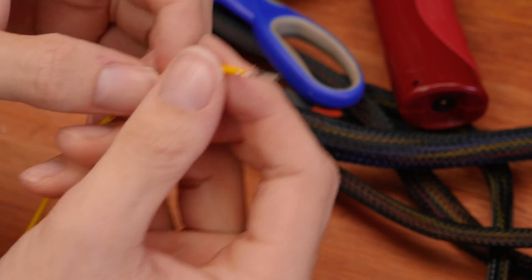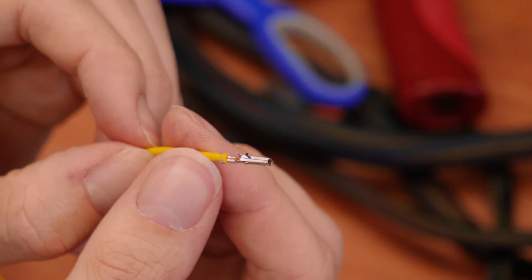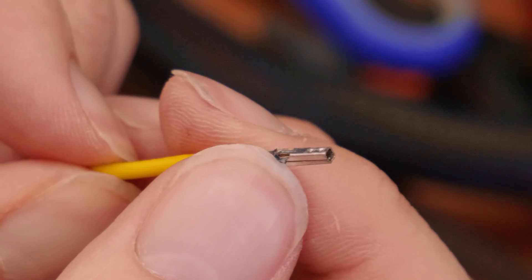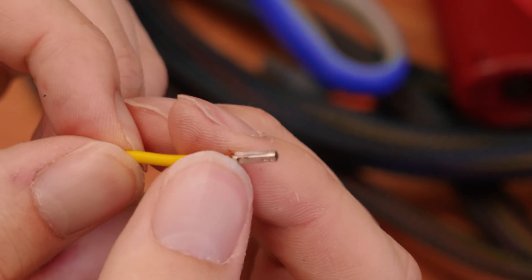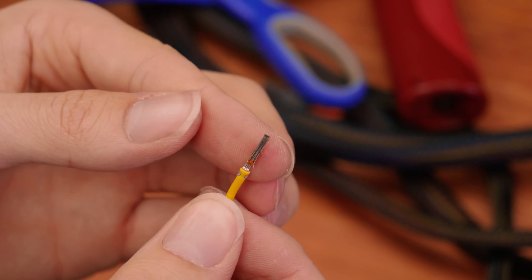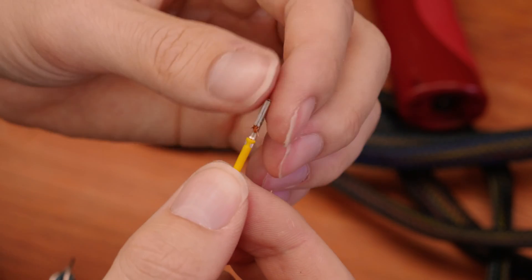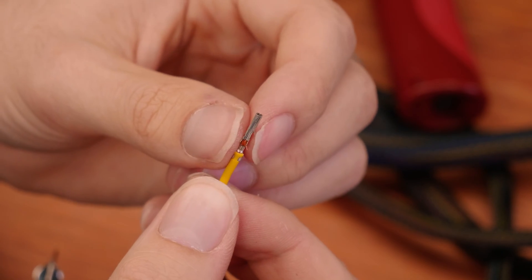So if we take a look at what we've actually got here — we can see it's a nice little square connector with wings on each side. So we can see one set of wings here. If we bring our knife up, we can flick one out to get a better idea. You can see right where my fingernail is — that's basically what holds it in. It goes in and connects so you can't pull it back out. Then what we do is simply push that little wing back in so it can pop straight out of the housing.